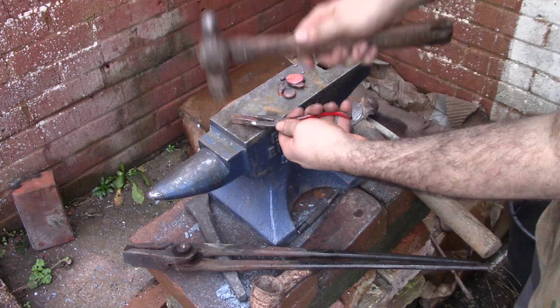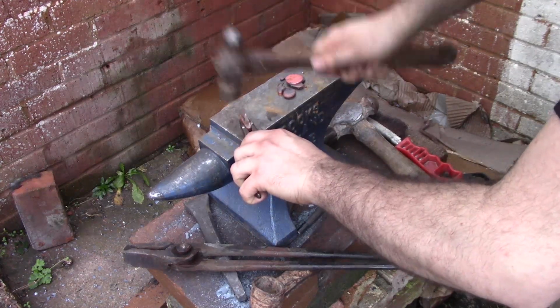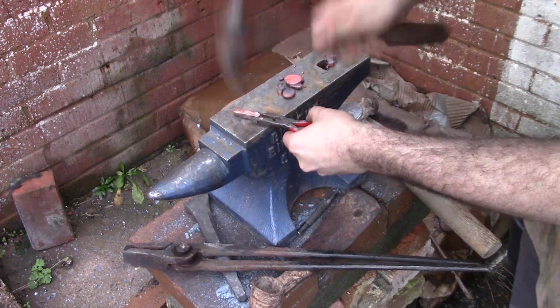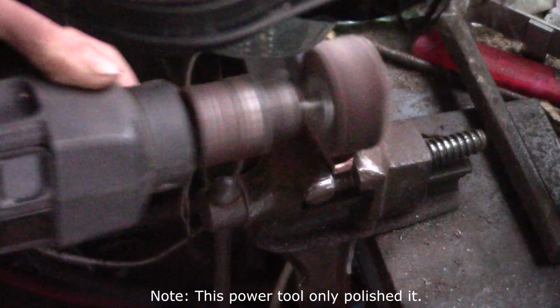and decided that I'd do some work hardening, which is something you can do with copper, where instead of getting something hot and forging it, with copper you can use it cold, put it on an anvil, and then just hammer it, which actually made me form it into the shape that I wanted without needing to use heat or any complicated tools. I literally got a pair of pliers and then got the hammer and just hammered it into the shape I wanted, which was surprisingly easy, and it didn't form any cracks in the meantime.